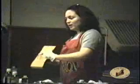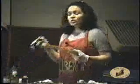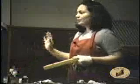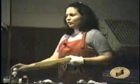Because what your shellac is doing is filling the grain. You're choosing a shellac. This is the hardest finish to apply, and it is probably the most beautiful. So if you're going to go with shellac, you know what you're doing. You're working with a beautiful wood. You would never do this on a pine. This is really ideal for mahogany. And you'll see this in all period furniture. If you go to any museums or fine auction or something like that, you can take a look at what the traditional French polish really looks like.